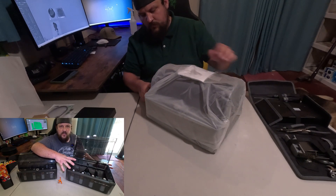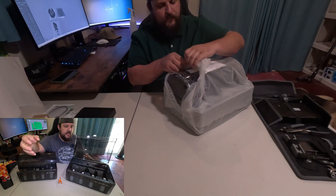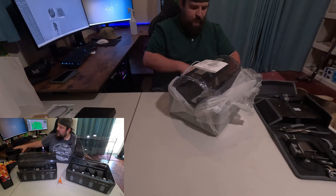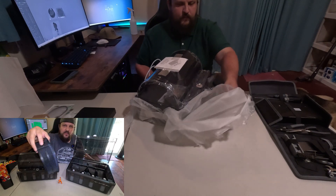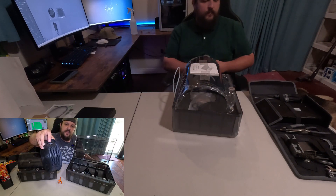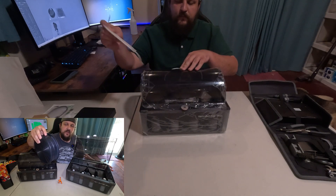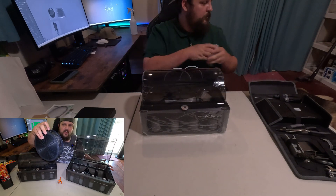The biggest feature that I think is absolutely amazing about this: I haven't had a filament dryer and I just moved to a higher humidity state. The AMS 2 Pro will now dry up to 65 degrees Celsius. I use this little 3D-printed silica gel spool replica with holes on the sides so air can go in and out — I printed it out of ABS. It seems to dry silica well at 65 degrees over an eight-hour period. I wouldn't recommend filling it all the way; about half works perfectly.